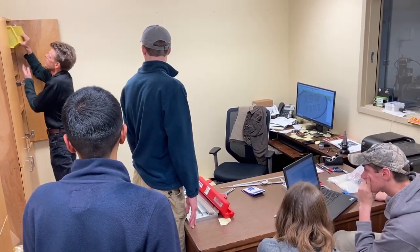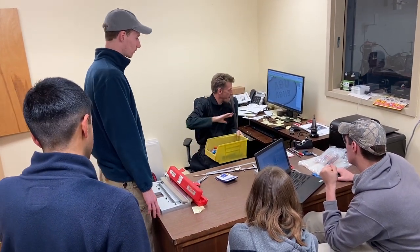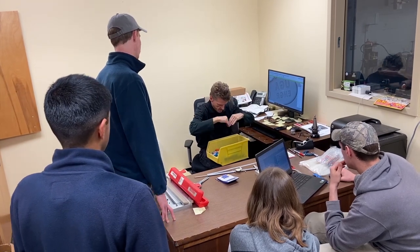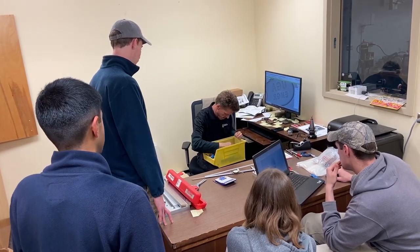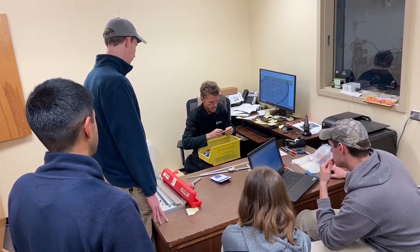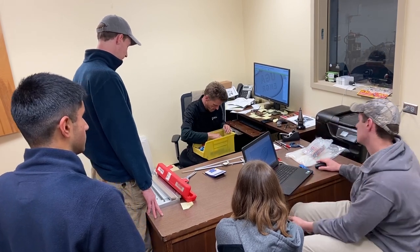The lettering of our AutoCAD drawing was small and finding an end mill of the right size was challenging. Programming the mill was also going to take some time, but during the meeting our group received some good news. One of our group members, Amon, had sent his father the design for the keychain earlier that week, and his father had access to a machine shop where he could make the mold for us. As it turns out, the mold was already complete and only needed some finishing and modifications in order to fit the shells of the injection molding machine.